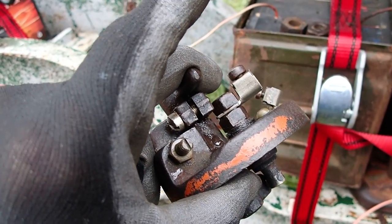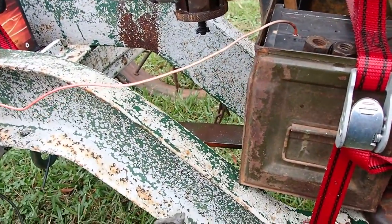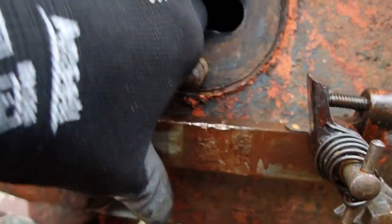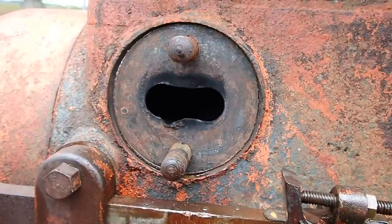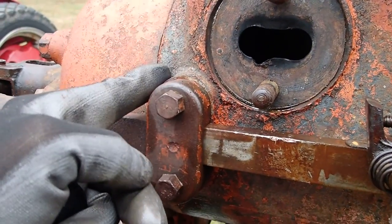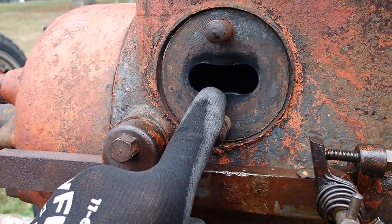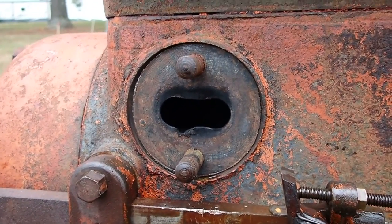I'm going to go ahead and look it over, make sure there's no cracks, and stick it back into the head. Just like all spark plugs, you'd think that it would be in the cylinder or right beside the cylinder. On this engine, I can stick my finger right in and feel that there is a hole down to the head up here. This ends the cylinder, actually, right here, but there is a hole through the top into this little chamber. So this is part of your compression area also. It creates a spark in a chamber which flash fires over into the cylinder to ignite it.